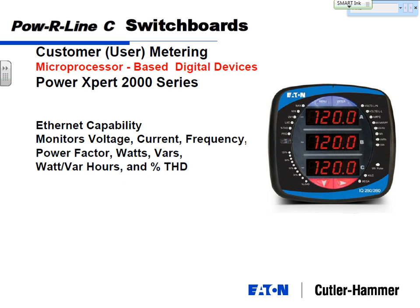You can step that up from our IQ family to our Power Expert series. What our Power Expert series does, it gives the same type of information that you're looking for, but it makes it Ethernet compatible. What a lot of people are doing now is, when I say Ethernet capability, you assign this meter an IP address, just like you can assign any other computers or anything else an IP address, run a wire and plug that into the LAN. And then once it's got the IP address, it actually has a built-in web server, so you can sit at any computer that's inside the firewall, bookmark, and pop up the IP address, and you actually get a full page of the meter, and it can tell you all the values, and you can do this sitting at your desk or sitting at home on the weekend.